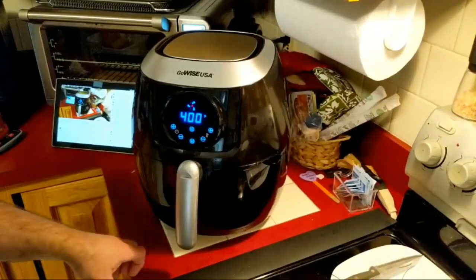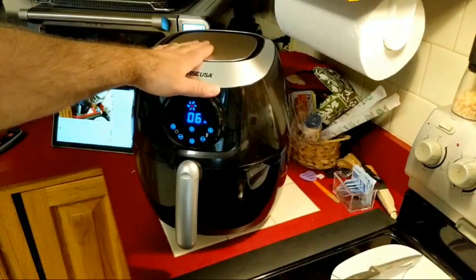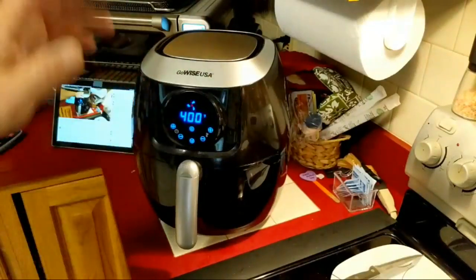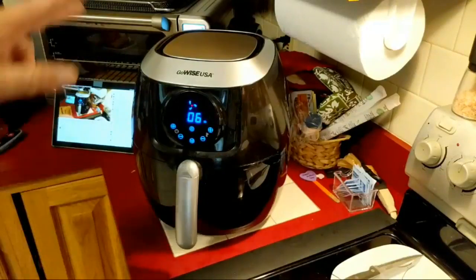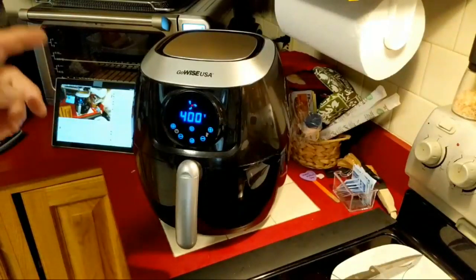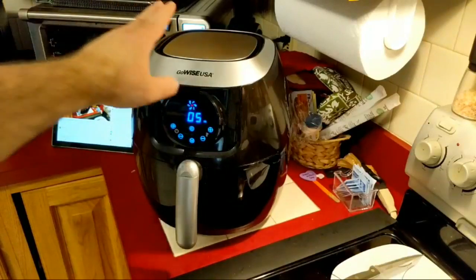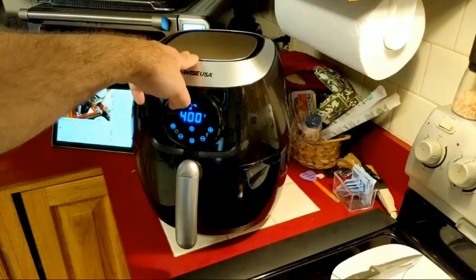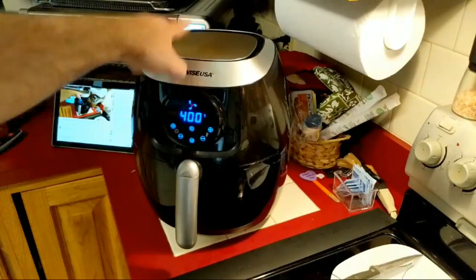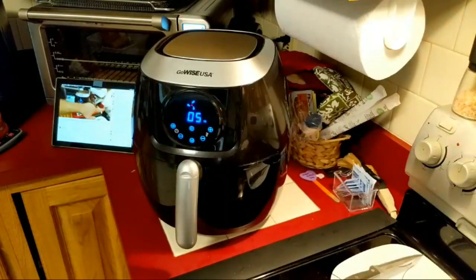Yeah, you really got to follow the guidelines on this. You really don't want to skimp. If you have a newer kitchen, you have dedicated circuits, but you've got to be careful if you don't, because you can have an air conditioner running on the same circuit as what you have in the kitchen. I have three dedicated circuits and two pass-by circuits here. One is dedicated to the Breville and the coffee maker, and I don't use the coffee maker. This shares it with the Breville. This shares it with the coffee maker, which isn't running. The Breville shares it with one of the outlets that is never in use, or very rarely. And then there's the dedicated kitchen refrigerator outlet, which shares it with some USB chargers.